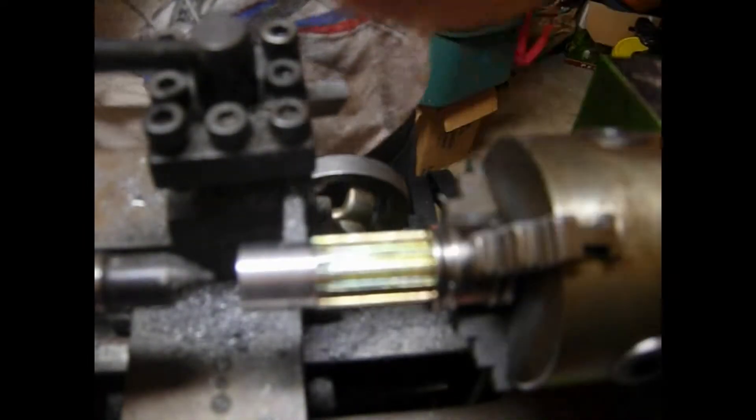As you can see, I've found a bushing that fits this exactly tight — I actually had to press it in — and that allows this to turn. We're in the process of turning this down now. Based on the depth of the original shaft, we want to duplicate its size. We zero out our gauge and it should be 20 millimeters. We're reading 20.13, or 20.02 when tucked tight. Right now we are down to 20.5, so we've got 0.5 millimeters left to go.